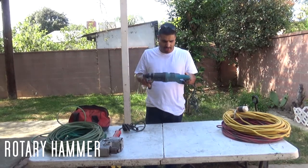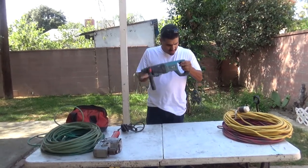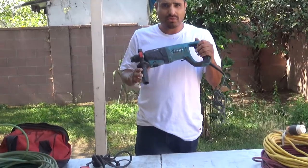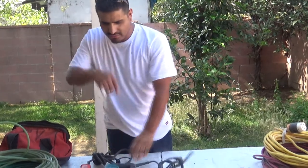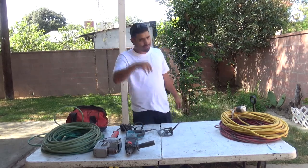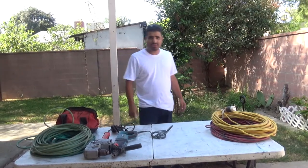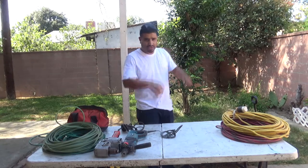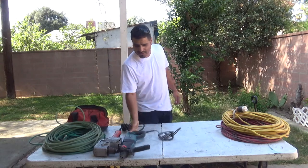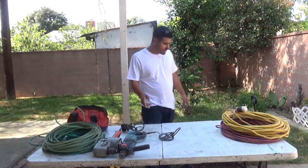I got a rotary hammer — I have a Makita one. Like I said, pretty beat up, but it's made me money. You use this to drill through concrete when you want to put in hold-downs, anchors on the floor, temporary holes where you put nails to hold up a wall. When you're putting up a wall and need to hold it down, you drill through the concrete — sometimes you don't shoot pins so this is what you use. Different size rotary hammer bits, good to have on framing jobs.